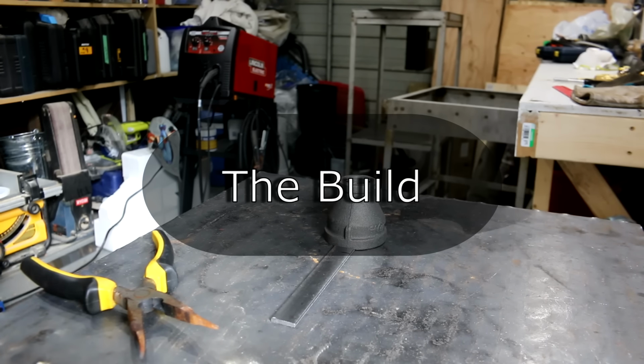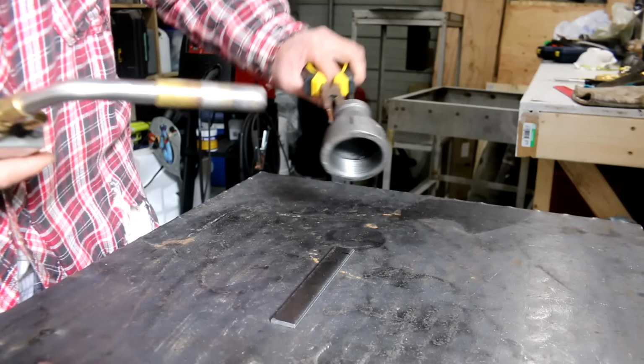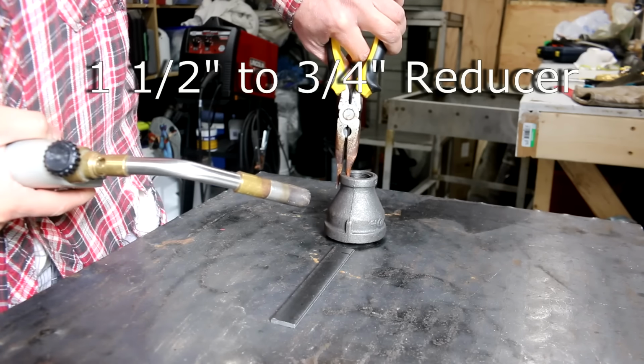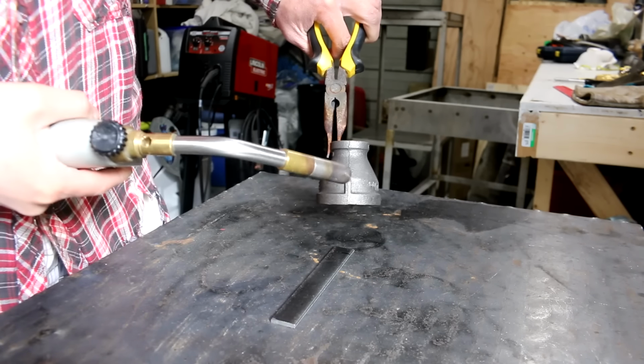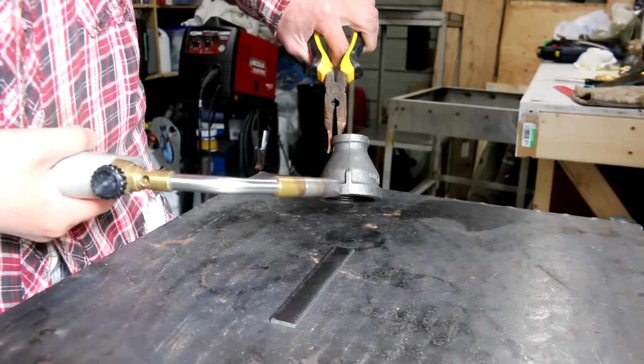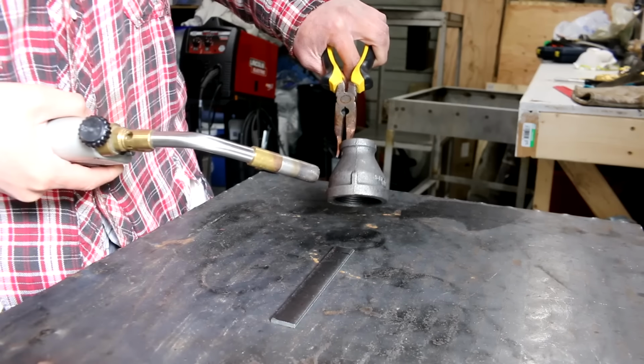Now I'm going to manufacture the burner. This intake is going to be the bell housing, and I need a way to mount the orifice to it, so I'm going to weld on some mild steel so I can tap some holes in this. You'll see how this will work, but I've got to preheat this cast iron and then weld it to the mild steel.